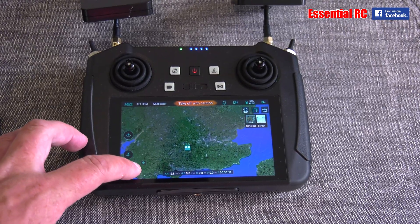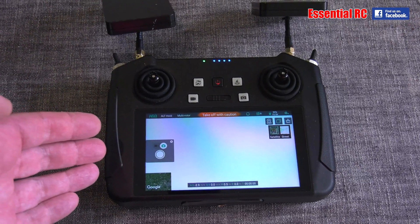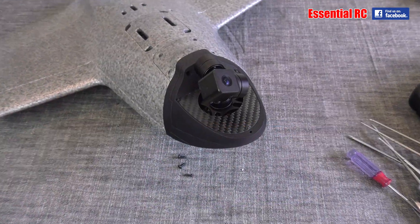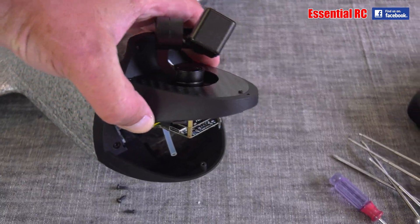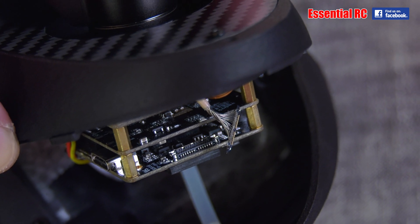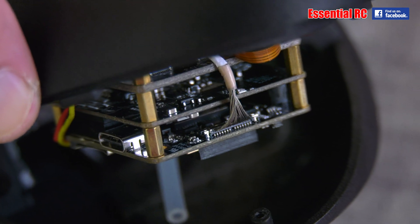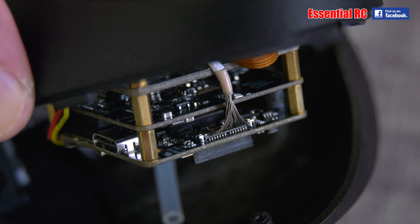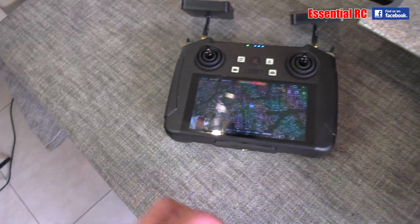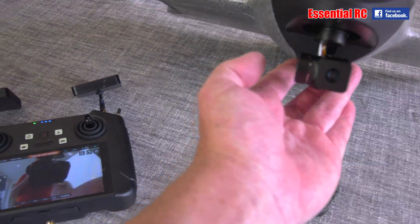One more thing to share: switching to FPV view on the transmitter from map view, you can see there was no image from the FPV camera after a rough landing. HEQ suggested the cable from the camera to the flight controller had disconnected. After removing three screws and zooming in, you can see the plug is disconnected from the flight controller. It's very easy to push it back in place once you know that. The lead is a bit short and the camera moving around could disconnect it again — I might use some hot glue to retain that plug in place on the flight controller. Once reconnected and the battery plugged back in, the FPV view is restored.